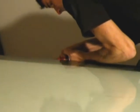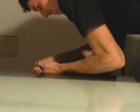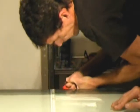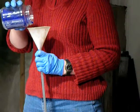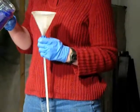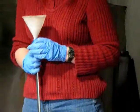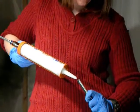Cut the rubber between the glass and frame for each pane of glass. Most thermal doors contain a desiccant within the frame. The desiccant will need to be replaced. Replacement desiccant, usually used to trap water in paint sprayer assemblies, will fit into the frame easily. Caulk both ends of the frame with clear silicone and replace the end caps.